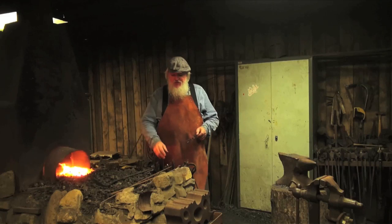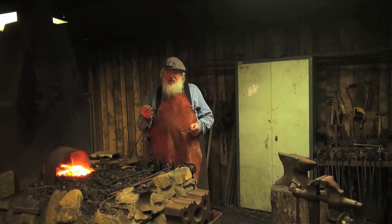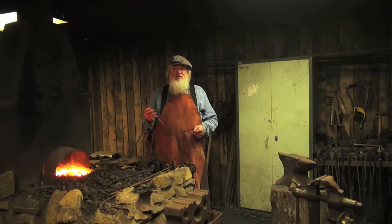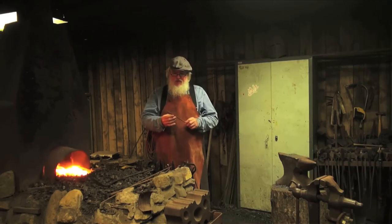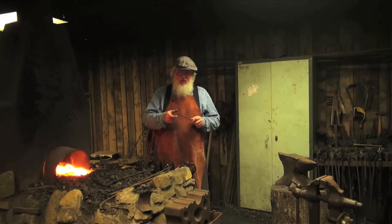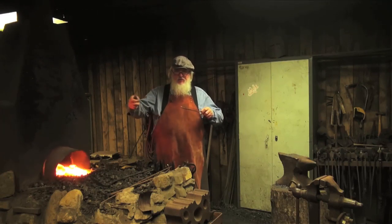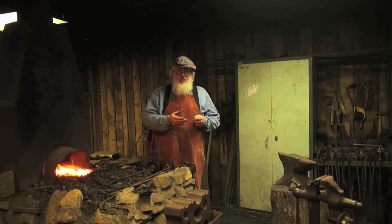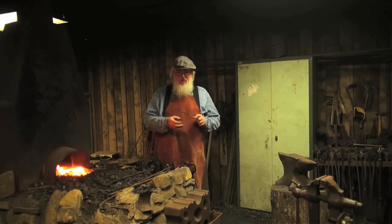One thing I tell people when we start shaping iron — if you've never done this before — when you get steel really hot, it moves like a really stiff clay. So if you've ever dealt with modeling clay, the way you stretch it out, or what the process is called drawing out in blacksmithing, is you create pinch points. Whereas with clay, if you pinch it between your finger and thumb, you can move the clay forward and make it longer. At the anvil, of course, this is too hot and too stiff — we have to create the pinch point between the hammer and the anvil.